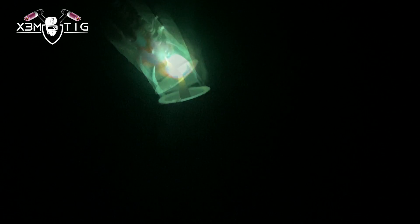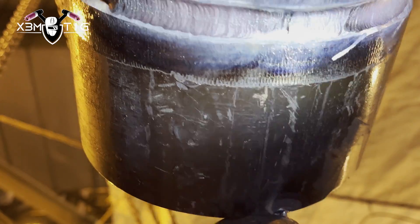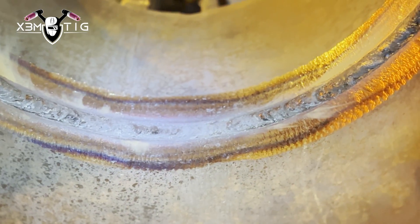Just to see what's going to happen to the root. Stretching side to side, trying to build up as much as I can. That's the bottom section — I only did six to eight o'clock and six to four o'clock, just the bottom part. Now we're going to see what happened to the root. Pretty much nothing — sides still the same, no suck-back here. At six o'clock, pay attention — it's the same, didn't change at all.